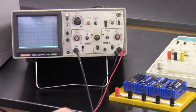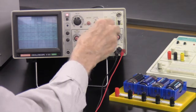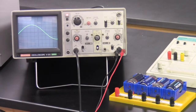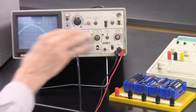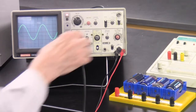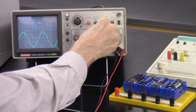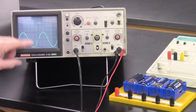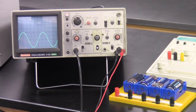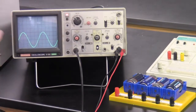The next thing is to measure some AC voltages. I've got an AC generator plugged into channel 2, so let's switch over to channel 2 and switch the trigger to channel 2. I can adjust the sweep to see basically two cycles of a sine wave. To measure the amplitude: lower the trace to the bottom and count up — it's almost exactly 4 centimeters. At 2 volts per centimeter, 4 centimeters is 8 volts — 8.0 volts peak to peak if calibrated. You have to multiply by your calibration factor to get the final value.